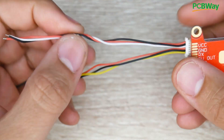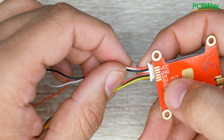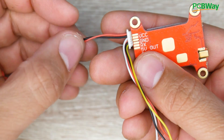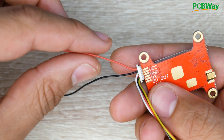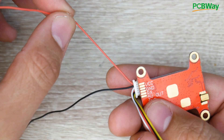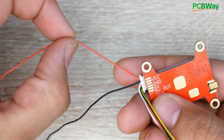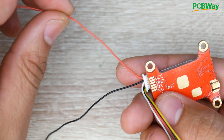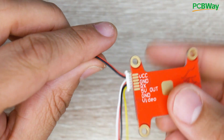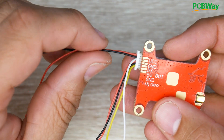For the wiring setup: there's VCC, ground, and a 5-volt output. Don't think this takes a 5-volt input — it does not. Power comes from VCC and ground, which are the top two wires. VCC goes to any VBAT pad on your flight controller or the positive battery connection, or alternatively a 9V or 12V regulator. Ground goes to any ground pad on your FC or ESC. Also important: never power on your video transmitter without an antenna, or you'll fry it and lose range.